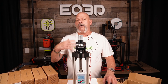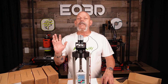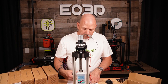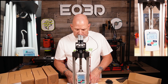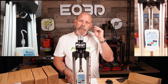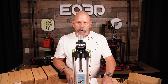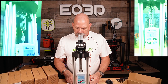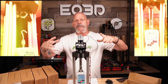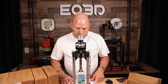Now the annealed pieces — again, there's no data out on this so I was guessing. Printed at 340° with an 80° bed plate, then annealed using my custom protocol. The vertical breaking point was 14.57 kilograms — not as good as the unannealed printed at the lowest temperature — but it was the best on the horizontal print at 47.19 kilograms. When I put the spreadsheet together and upload it to Google Docs, I'll give both kilograms and pounds.